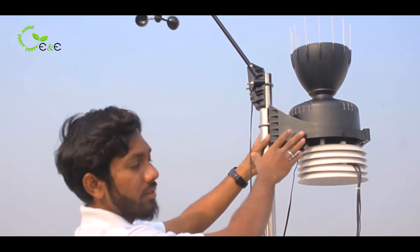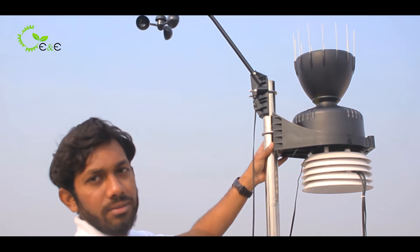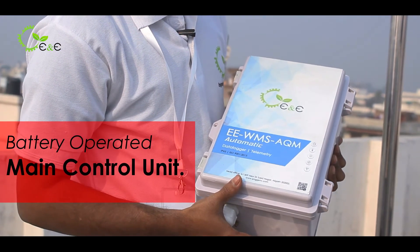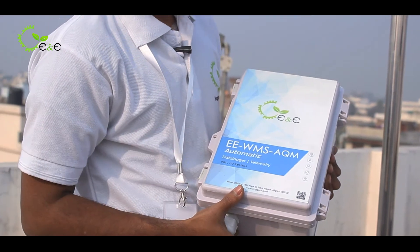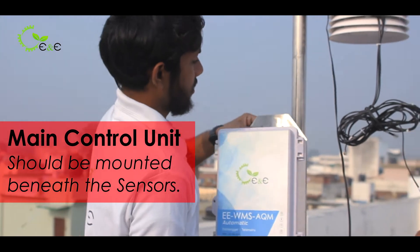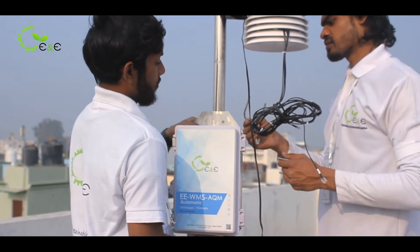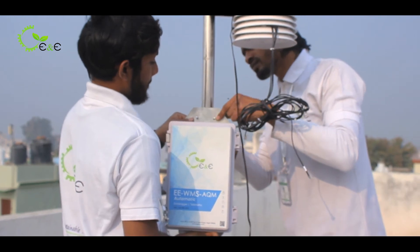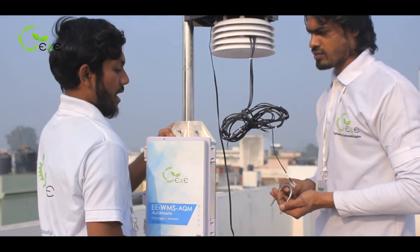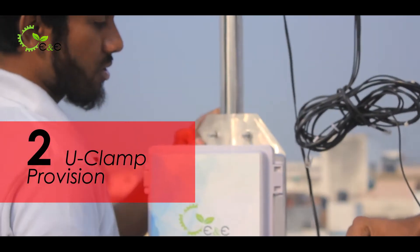It is important to maintain a three-centimetre gap between the sensors. Place the aerocone sensor exactly opposite to the wind speed or wind direction sensor. This is the main control unit, which is battery operated. I will show you how to mount it on the pole — make sure it comes beneath the sensors. You have to place it using U clamps on the mounting plate, and use two U clamps to ensure against slipping.